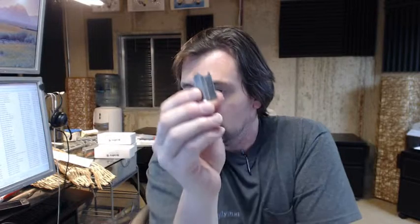There's a set screw down in there — slotted — and I've got a little screwdriver here. You rotate that counter-clockwise to get it down and you can remove your wall plate or anchor plate. You basically attach that to the wall, and be mindful of your height. Be mindful to be compliant with ADA regulations, and be mindful to comply with the height of other items in your bathroom as well.